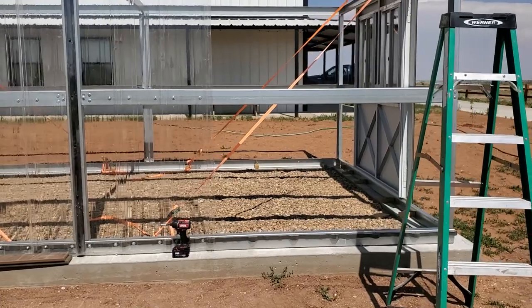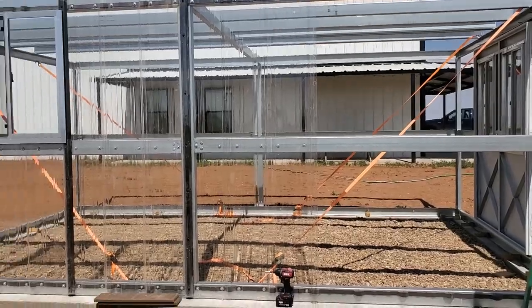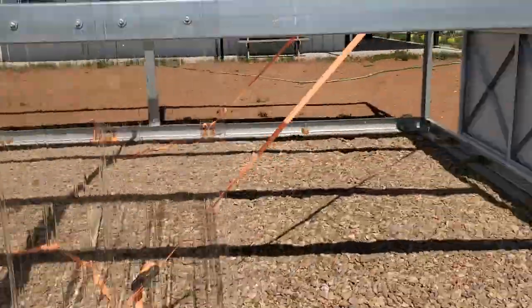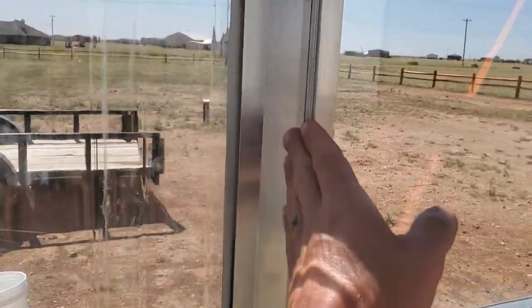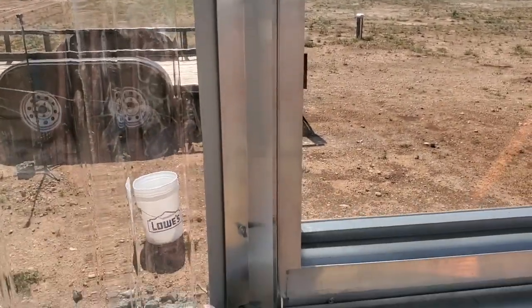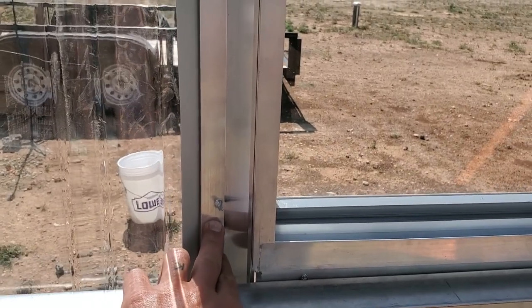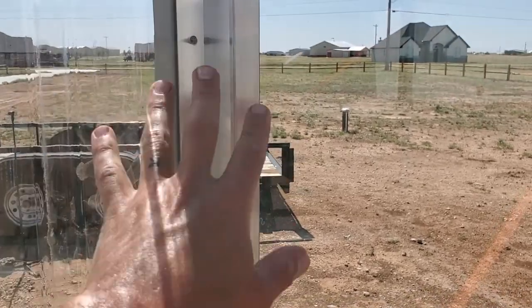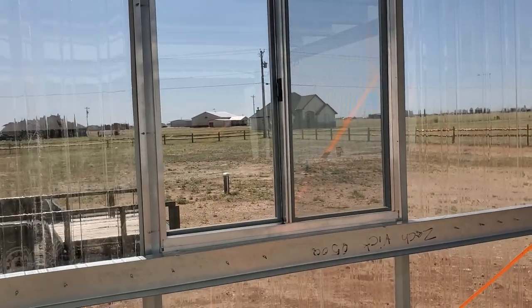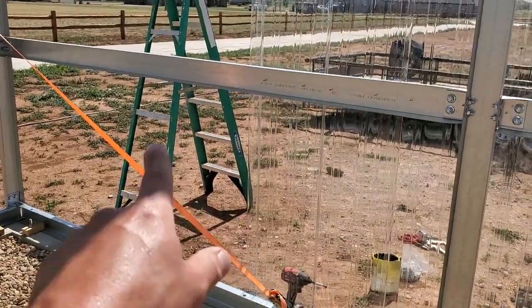So we are going to have another one of these lap stiffeners. On the windows you also have the lap stiffeners, but you have these aluminum fins on the back side of the window that go behind the stiffener even. You can see here, the screw goes through both sheets of plastic, the lap stiffener, and the aluminum fin. So you've got to tuck all this in together, and I'll show you how to do that, because there were not very good instructions on how to install the windows. But first things first, let's put the half sheet down here.